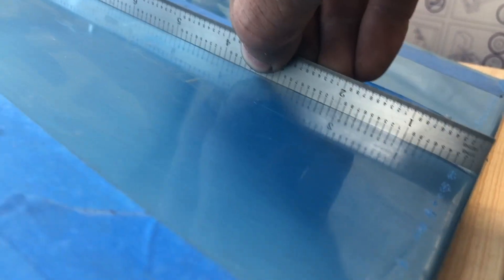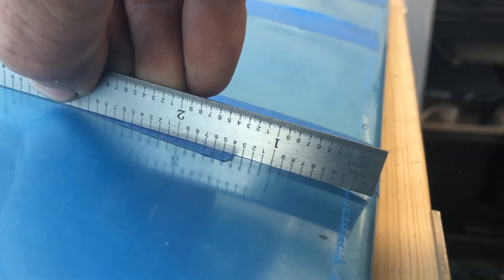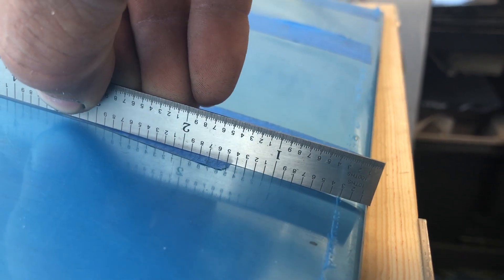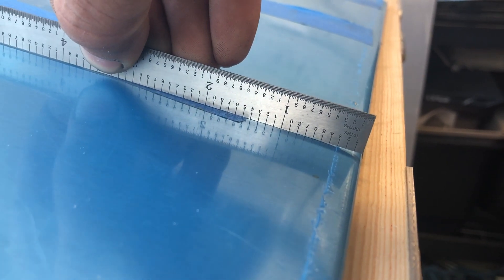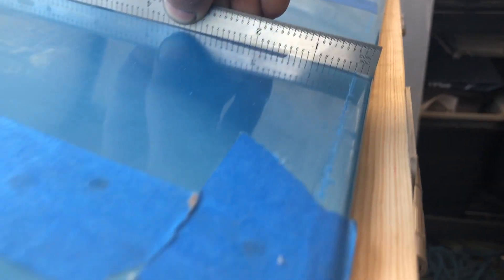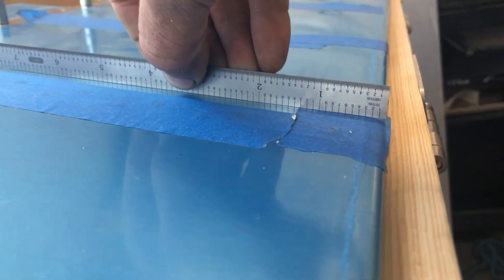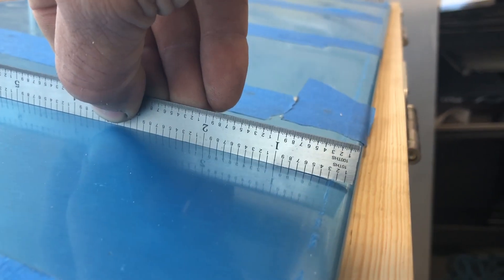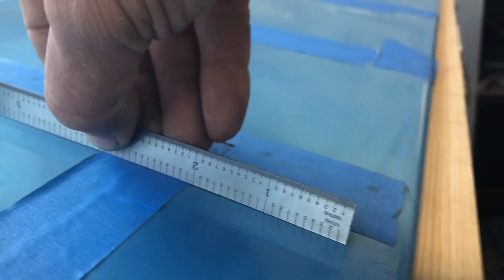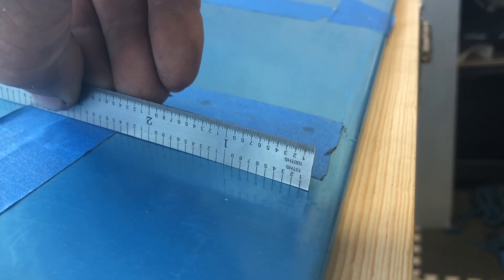If I check every station — might be a little bit more work to do with this guy. I'd really love some comments. I think I still need to do a little bit more here. That 1/8" filler is actually kind of preventing me from getting this last little bit, so I think when I go down to the 3/32" filler, I'll be able to get this nice and a lot tighter. But I'm pretty darn close I think. A little bit of work to do here. So I mean that's not great — I think we can do better.